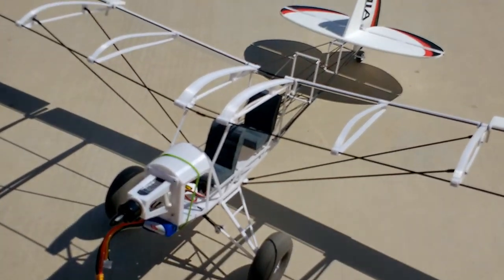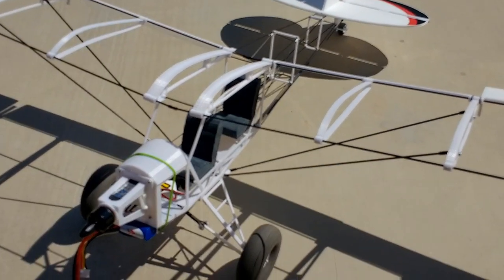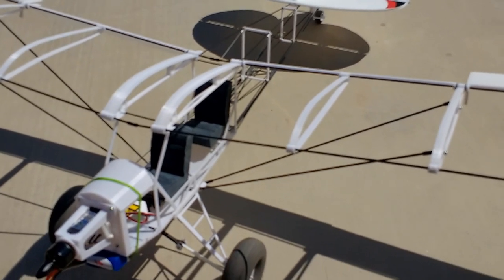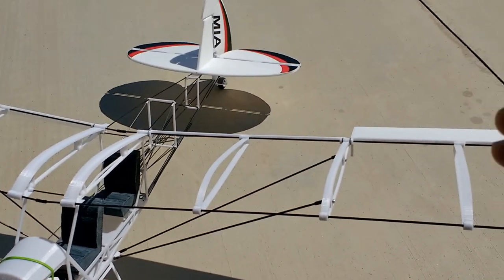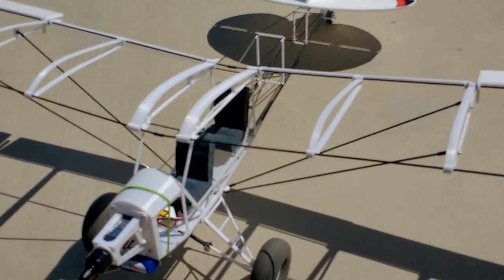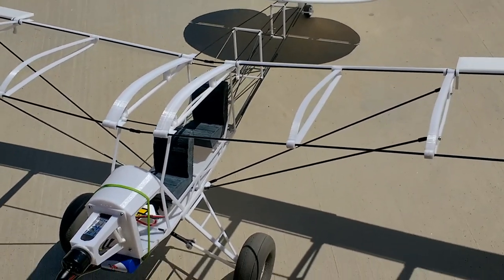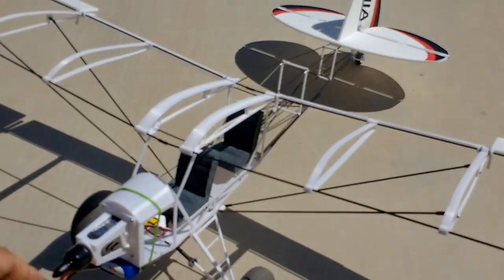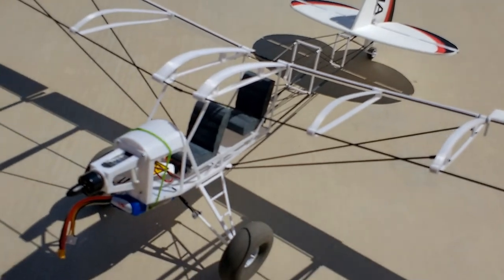There are ways I like to approach these things that I've mastered over the years and continually use because they work. A lot of my designs follow the same format — that's why many of the airplanes you see here share similar assembly techniques. I use carbon rods for leading and trailing edges consistently on all my products. Some other people build with a lot of ribs, wooden spars, center spar, and rear spar — I don't do that. Over the years I learned what not to do and how to build things properly, and in my opinion this is the proper way to design a model that will withstand crashes.